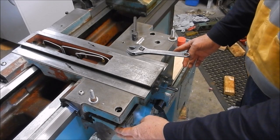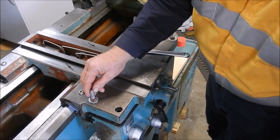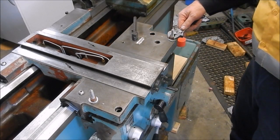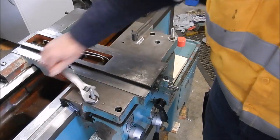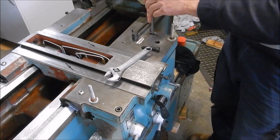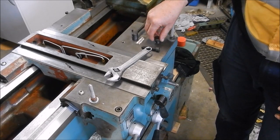Alright, so I've lifted the apron into place with my crane and I've set it down on these timbers here. I've had the saddle off one side, dropped the apron on the timbers, then pulled the saddle back over the top of the apron. I've dropped this all-thread through into the threaded section of the apron with some nuts, and all we're doing is basically screwing those two to raise it up until we can get a bite with the socketed cap screws that go in here. I'll just keep on with that process — very gently, just make sure everything's going up nice and even and nothing's going to catch. It all looks good. We'll just drop those socketed cap screws in there and see if they'll catch. Alright, we're under control.